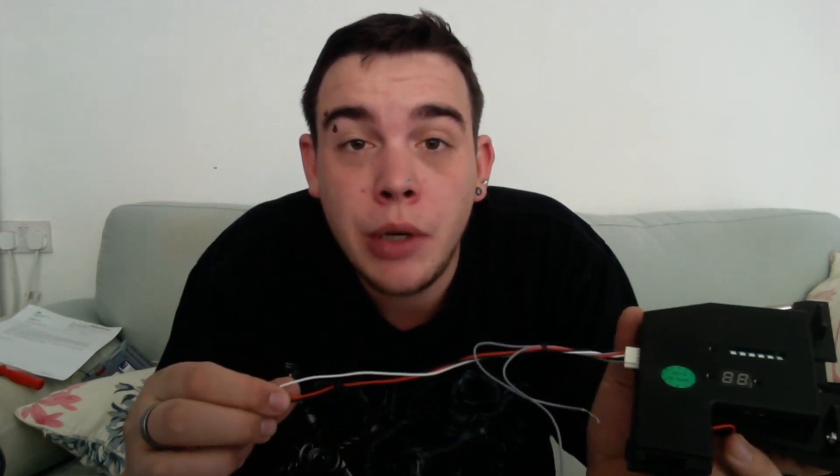Once we've wired in the mains wire into the power supply we're just going to put this aside for now. We're going to be using our coin mech — this is a cheap Chinese coin mech, quite useful for homebrew arcade machines as it allows you to program in whatever coin, currency, or tokens you like. It runs very easily off a 12 volt power supply and has a simple pulse line which delivers the amount of pulses per coin. So you could have a pound delivering 10 pulses and five pulses for a 50p, for example.